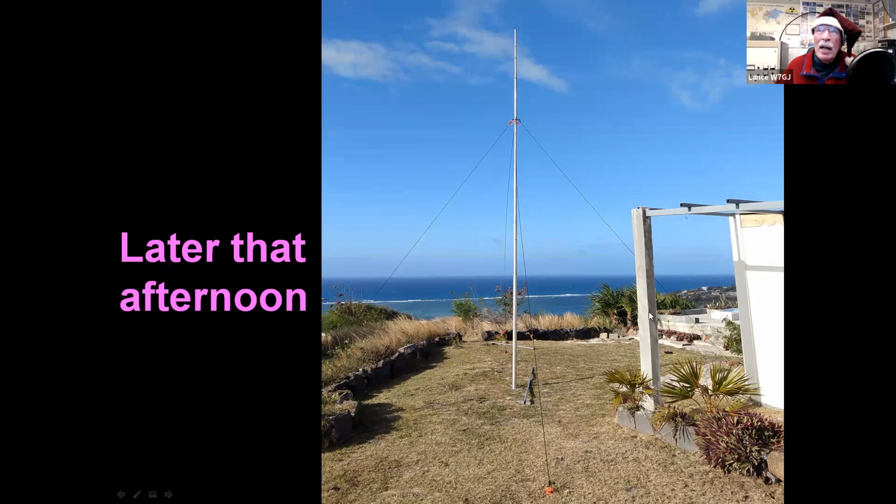And I was going to be limited here by this structure of part of the building where we were staying. I couldn't elevate fully when the antenna was pointed due north, but as it turned out, I thought, well, that's probably not going to be a problem, because North America can't see me when I'm fully elevated anyway. And nobody in Europe is going to be interested in 3B9 because they've already all worked 3B9FR. And as it turned out, I had other problems like weather that would have prevented me from elevating fully anyhow. So it was a good spot to stick the antenna, and it was close enough to the operating position that I only needed 50 feet of coax.